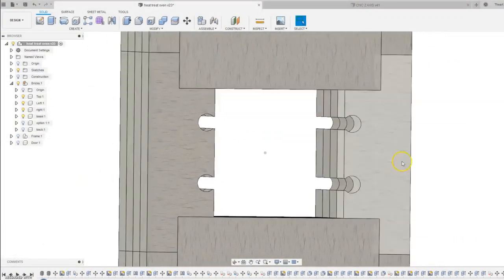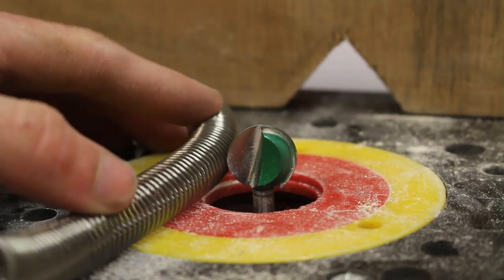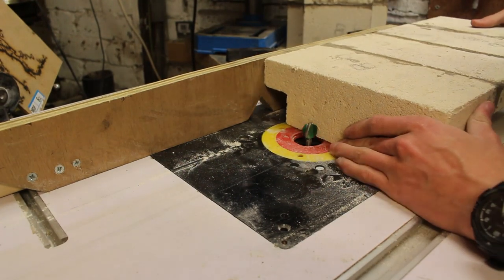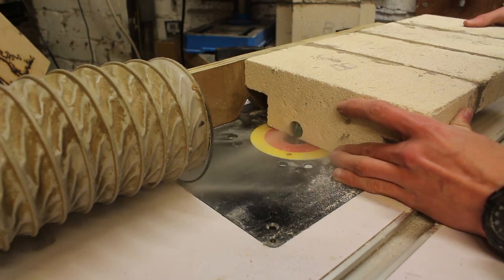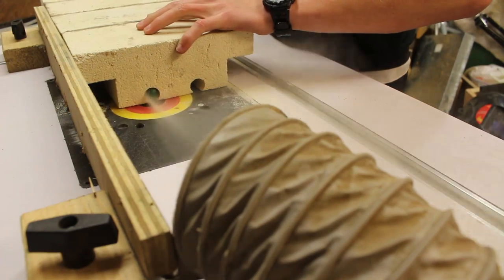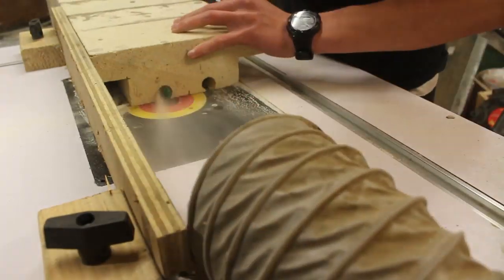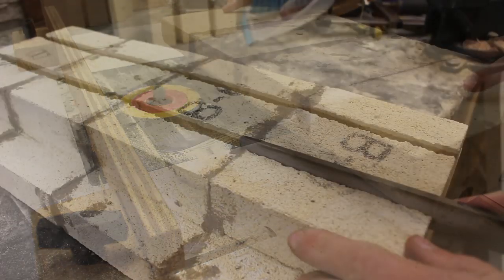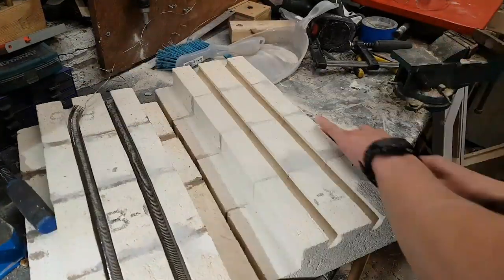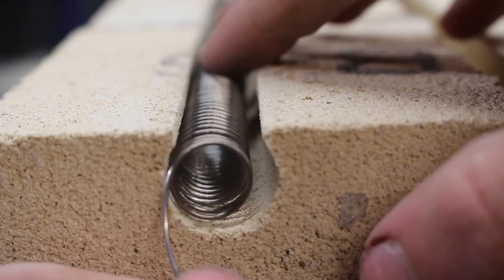Now I've made the coils it's finally time to get back to cutting those slots. I'm going to be cutting two slots in each side wall and the coils are going to run down the length of them. I'm going to be cutting the slots using a 20mm circular router bit. I've made some test cuts in the brick to get the right depth and the coil fits really nicely inside them. Since the bricks are so soft the router table can easily make the cut in one pass. I then use an old blunt metal file to widen the gap in the slots so the coil can actually fit inside them and clean up all of the edges so the bricks are nice and square and parallel to each other. You can see how nicely the coils fit inside the slots and how they're overhanging so the coil isn't going to fall out very easily.